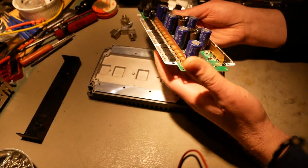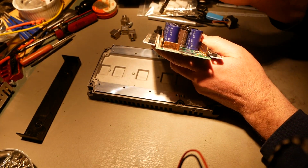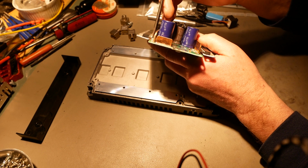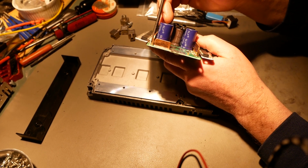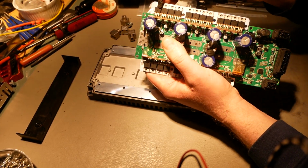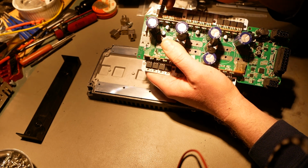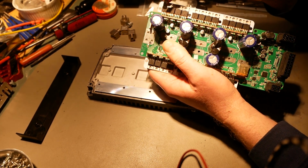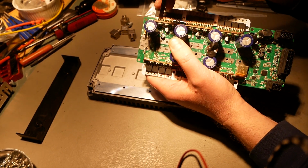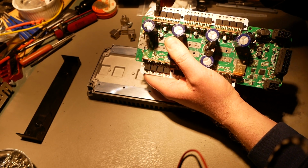All of my complaints happen on the top side, and one of them is right there. Yeah, I love Magnachip MOSFETs, but you can see that MOSFET leg right there. They're using the full length of the leg, so they're building up a considerable amount of heat in the MOSFET leg, which just makes the MOSFETs hotter. And what they really should have done, since these are TO220 MOSFETs, is they should have used the fat section of the MOSFET leg and butted that right up to the board. That would have shortened the leg length significantly, and it would have lowered the amount of current that has to pass through the leg, and it would have been doing it through the thick section, which is rated for 75 amps, unlike the skinny part, which is rated for 50 amps. That would have been a lot better if they would have done that.